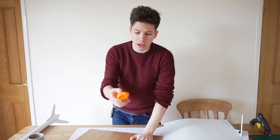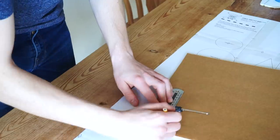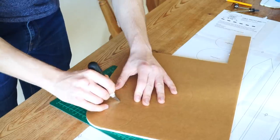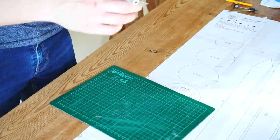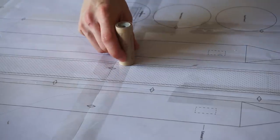We've also got a little parachute that I made. All of this stuff, all up, it's going to cost next to nothing. The first part of this build I've just spent cutting out some of the first pieces that make up the formers of the booster rocket — about five of them, just cut out of this foam board. Now we're ready to go on to the next bit, which is the motor mount. We're going to use the SS motor as a guide, wrap it up in some paper, and then cut the formers and make a really solid mount.